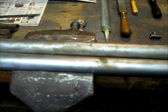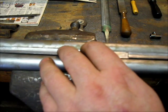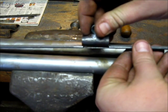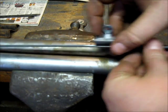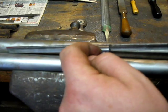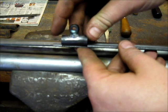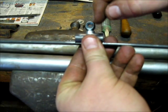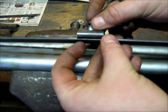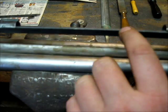The way I like to do it is to take one solid rib the whole length, contour it to match the ramrod, then machine the pipes flat and the rib flat so they fit together really nicely. Then I TIG them together so they're one solid piece. This pipe here is the one with the tab for the forearm key, the one up front is a plain pipe, and the middle one will have the swivel — so it's made in two pieces: the pipe, then the swivel TIG'd together, filed down to a nice shape. Then I TIG the swivel assembly onto the rib, file the edges, and fit them to the barrels, ready to solder on.